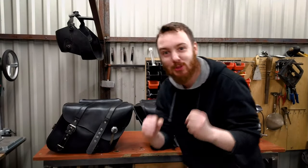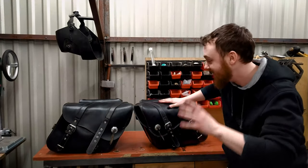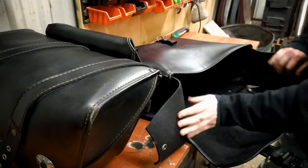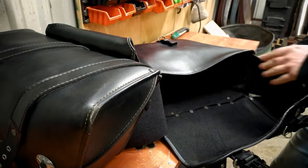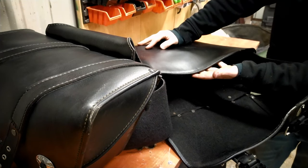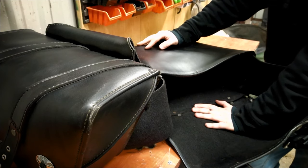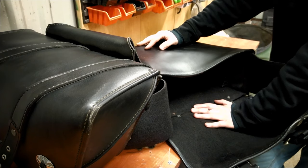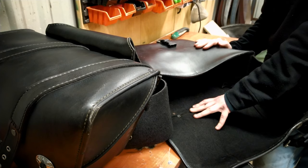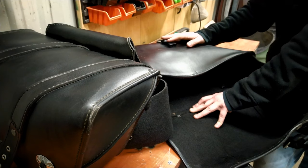So guys, I'm absolutely thrilled. This is an amazing effect and I didn't think that it would look that cool. But there are still a few things that must be fixed, and what we are going to do right now is fix the front of the bag. As you can see, there is a little bend despite the reshaping. And I believe that if I don't support the edge somehow, the front will be bent. So I will rivet a metal plate to this edge, and I think it will be just enough to make the front side flat. So let's make it.